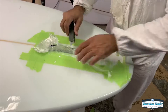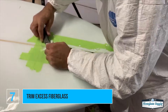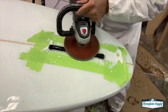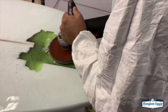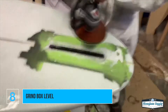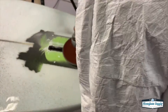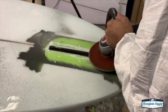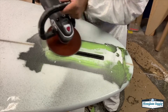The resin is cured now and we're coming through with the utility knife, just trimming off all the dry fiberglass on top — that leaves wet-out fiberglass. You can see the excess resin on the tape so it's not a big deal; once we're done grinding we just pull that off. Once it's cured and we've trimmed off the excess fiberglass we're using a grinder with an 80-grit pad. You can go rougher — we just happen to have 80-grit in the shop. We're carefully taking that down a little bit at a time. You can't leave the grinder in one place too long because the plastic will get hot and soften and it doesn't sand as well.